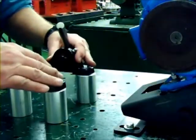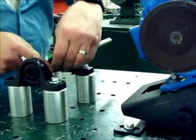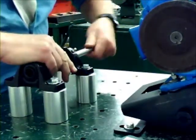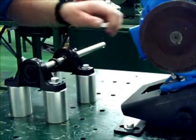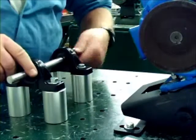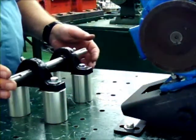Now, with the bolts in place, the next part is to install the shaft and slide it through the holes in the pillow bearing. First one bearing, then put both rings in place, then slide through to the next bearing. And this is why you want your bearings loose, to get rid of all in-loading so you have plenty of space to move with. So you want to have these kind of free floating to maximize your spacing here. Once you've done that, and I'd keep them free floating, frankly, we'll have the shaft in so it just about lines up with the motor.